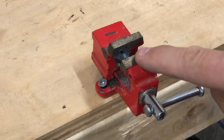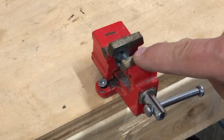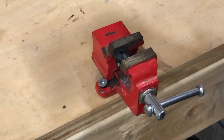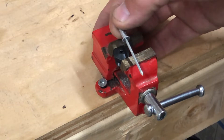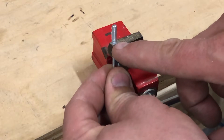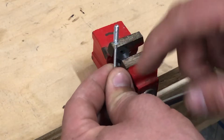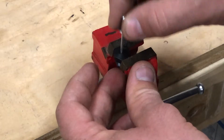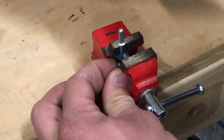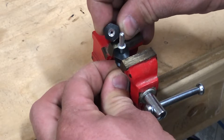We are starting out with an A5 rivet head. It's flush here and we want to make it dome-shaped so we can have that nice dome required for the Zenith aircraft. The A5 rivet is the countersink style, 120 degrees. This is the proper nose piece for it, but I need to make a dome very similar to the A4 example.